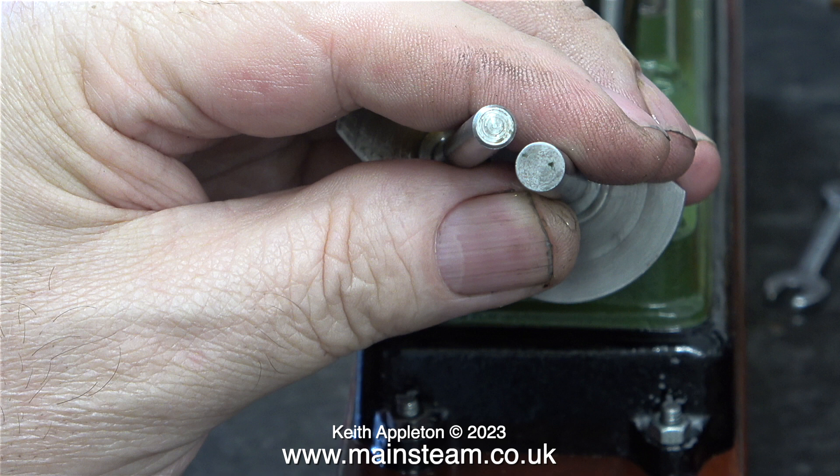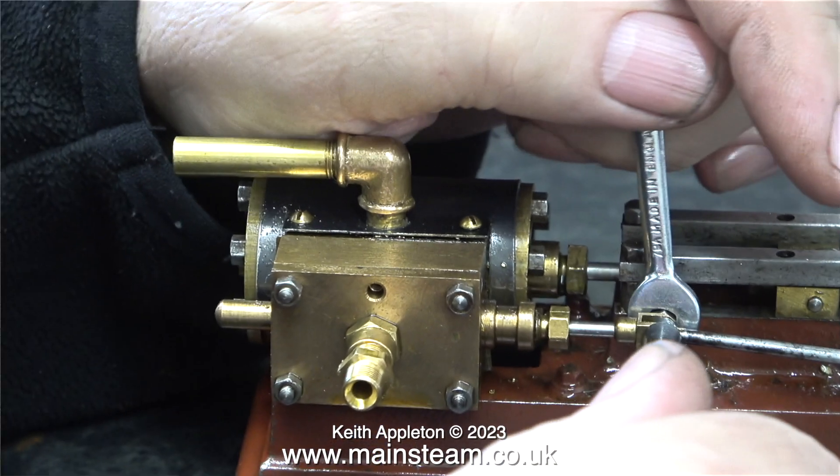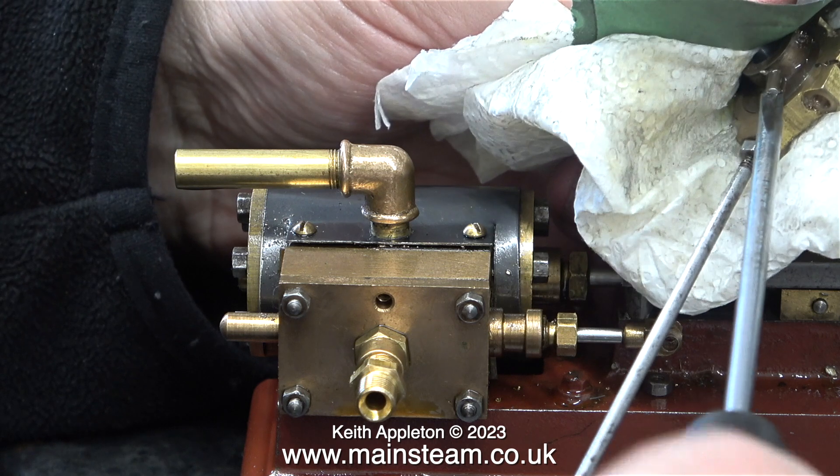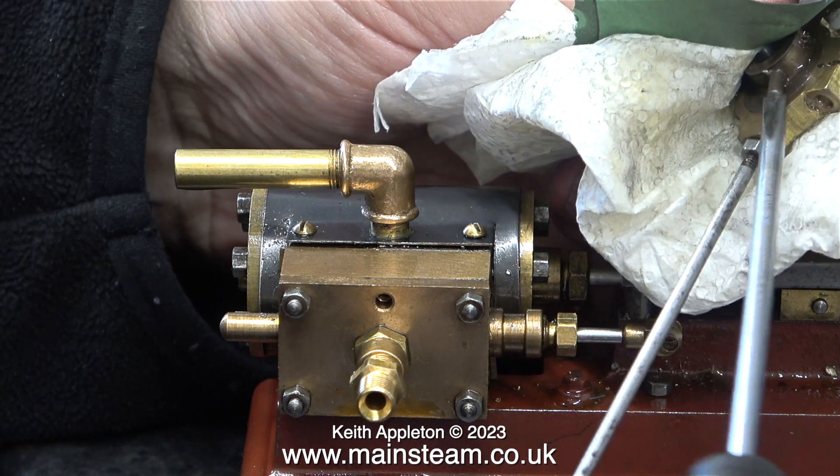Here are a pair of crankshafts with attached crank webs. The right-hand one, which is 9/32nds of an inch in diameter, is from the factory kit. The one on the left is a quarter of an inch in diameter and has been taken from the engine I've just dismantled. In this clip I'm disconnecting the eccentric rod from the valve fork, and here I'm disposing of the slot-headed grub screw.